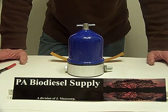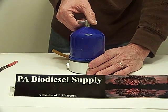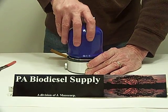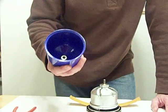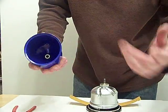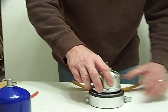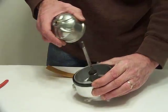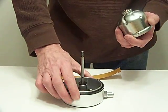You can get rid of your filter bags, all the filtering, all the mess that goes along with it. Let's take it apart and explain things. This is the cover. After you've been using this, you can pull this cover off and other than maybe some mist, oil is not going to be pouring out of here. The oil all falls into the base of the housing, so you can pull this out — this is where all the oil would be laying.